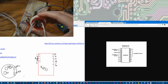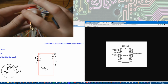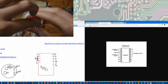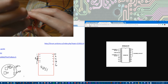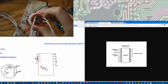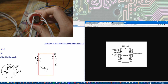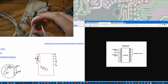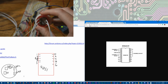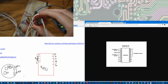There's actually a PCB inside in the top of this button, which in the actual video I do for the project I'll open up and show you. But the top one here, right across from the data pin for the button, is also data for the LED, and then below goes to ground. If you just want the LED to show, you can hook this up to ground and you'll get a similar effect, but if you're using this as a dedicated button and you want the button to turn on the LED, put this one to ground.